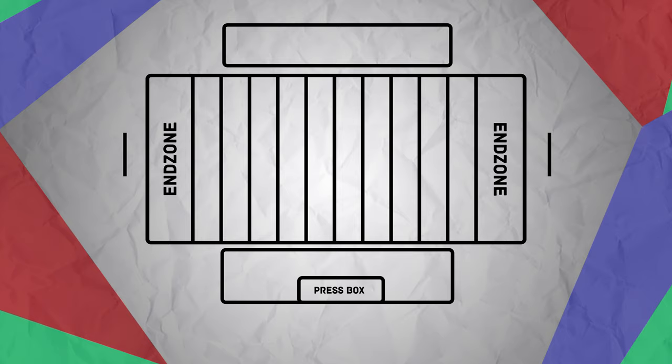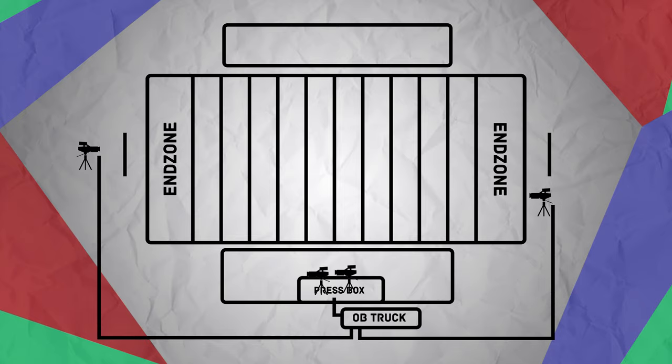Anyways, let's talk a little bit about the application of this project and then we'll get into the design. When setting up for an outdoor broadcast, using a football game for today's example, the first thing is figuring out where you're going to set up your unit. In a perfect world, you would more often than not want to position it in a location that would yield the most ease for setup. This would mean parking in a location that would give you the shortest cable runs to your devices, such as your cameras and microphones. However, like anyone who's been doing this for long enough will tell you, this perfect world scenario is about as common as a news anchor showing up on time for a mic check. And because of this, the length of your cables and the route you need to take to get them back to your unit can play a significant part in your setup time, but also your transmission medium for signals.